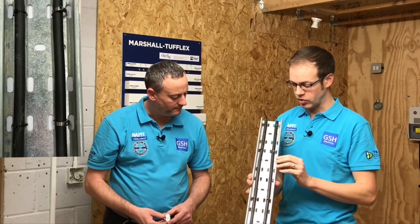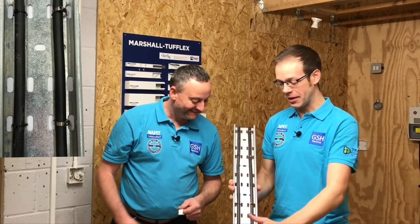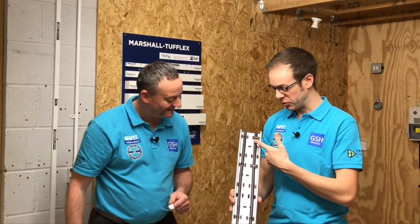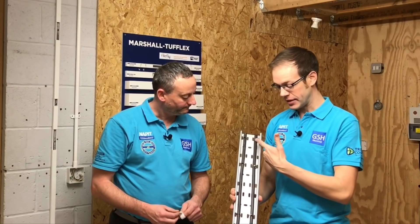We've got two armoured cables installed on this demonstration tray. On one side we've got plastic cable ties securing the SWA, and on the other side we've got metallic cable ties. That might be a bit over the top — metallic cable ties are more expensive than plastic ones. But is it necessary for every single cable tie to be metallic? No, not at all. The electrician's professional decision will probably be something like: every couple of meters or every meter and a half — plastic, plastic, plastic, metal — then repeat.